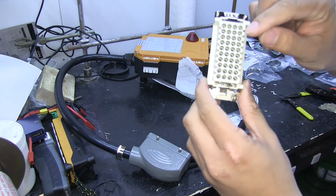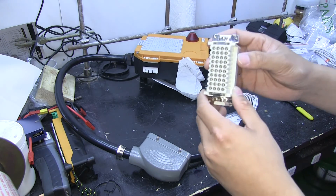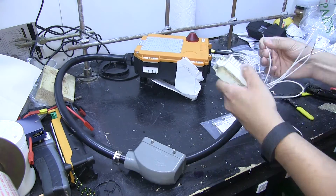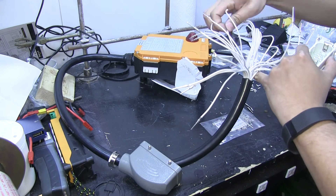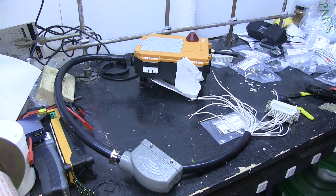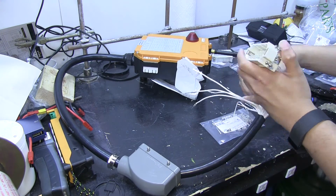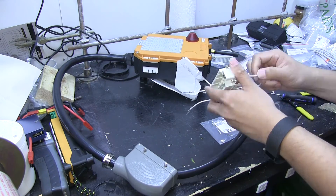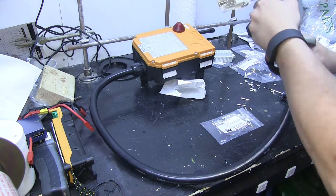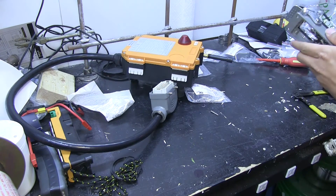On the reverse of the connector, we have numbers and letters — A1, A2, A3, A4, etc., through B, C, and D, 1 through 10. Once you have the pins crimped on, all you need to do is press-fit them into the plastic insert and you're done. Make sure you get them in the correct order, because you need an $80 tool for pin removal if you make a mistake. Different tools for 10 and 16 amp as well. The connector is designed so that it mates in sequential order — typically ground makes contact first, then pin 1, then pin 2, etc. This ensures no electrical faults from missing ground or voltage rails in your device.